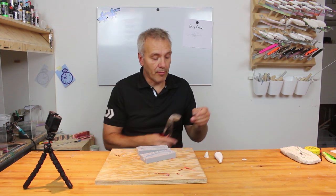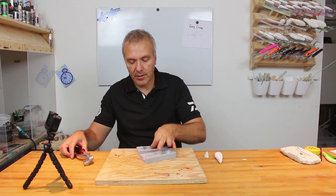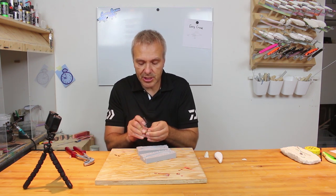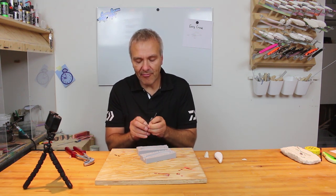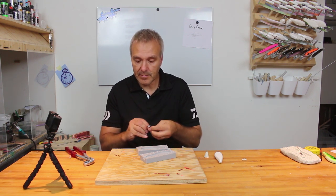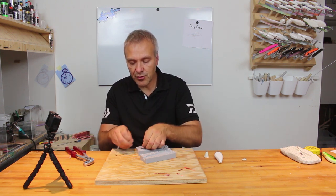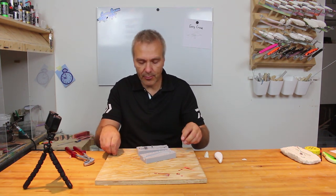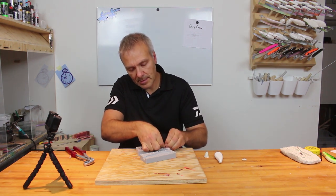Okay, I'll just grab a plier to make sure that it stays there, squeezing it. Okay, so now the thing is in place, and I'll just put in the pins. And as the wire has been bent around the same pins as the pins in the mold, they are a bit tight, so I might have to just squeeze them in there right away before putting it into the actual mold here.